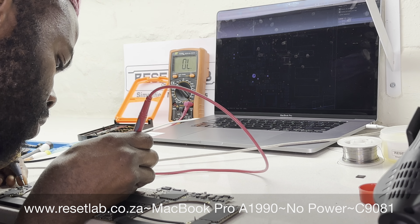We decided to remove the cap from the circuit and check again to see if the short was gone. That cap failing in that region is pretty delicate. After taking out the cap from the rail, we measured again — we no longer have a short. Black probe on ground, red probe on the line — confirming no short. That tells us our problem was the cap all along, though for a very brief moment the cap was functioning before it died.